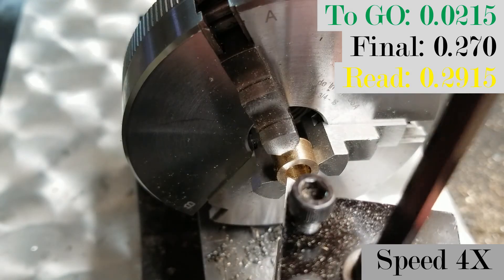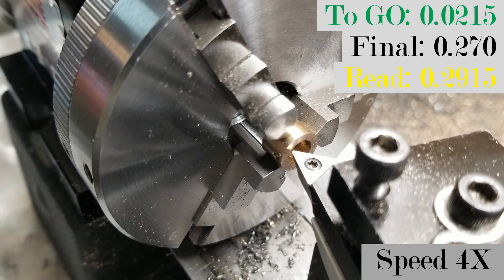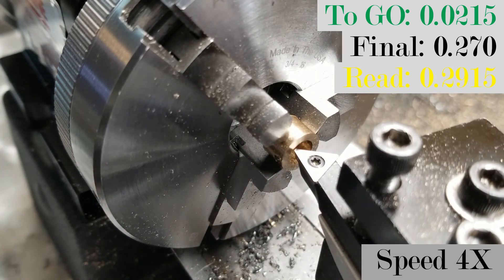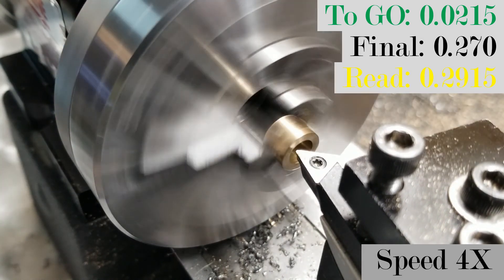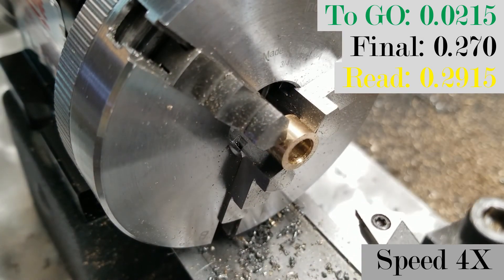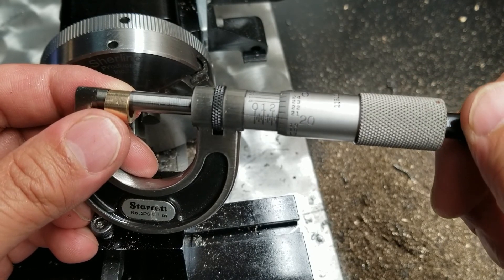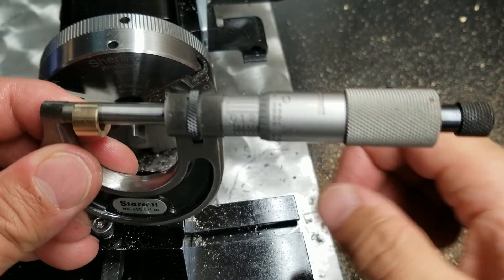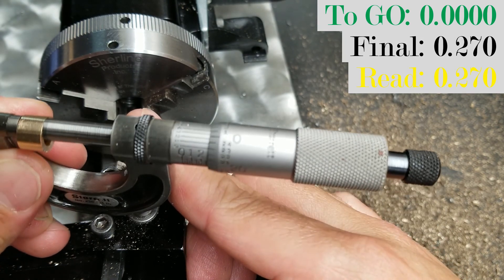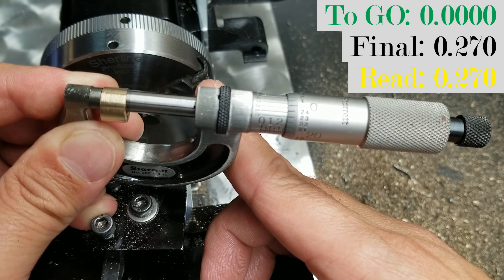Now doing this internal chamfer, I found I needed to change the orientation. The way I'm doing it now is much better — the tool holder has about even amounts of sides sticking out over the cross-slide table, giving a much better finish and more consistent angle. I'm going in and touching off, bringing it in a couple to three thousandths, and it gets every single one pretty consistent. So here it is — did the journeyman method work for me? It looks like it did — 50 plus 20 is 70, and my tenth line lines up pretty good with zero. Not bad, I'm happy with that.